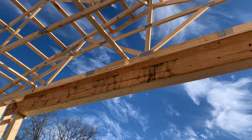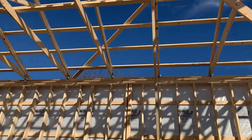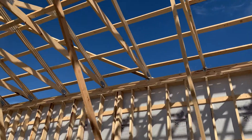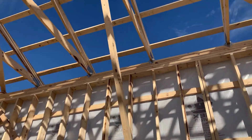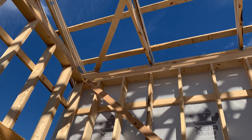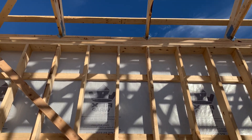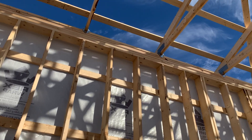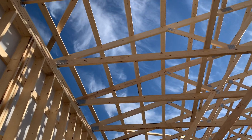The LVL blocking is there on four-foot-on-center truss spacing. Look at what we had to do for setting these trusses — we put one, two, three, four, five — five two by sixes stacked up on those trusses, and we stabilized them with hurricane ties. The reason we had to do that was to get this up to the correct height based on this foundation.